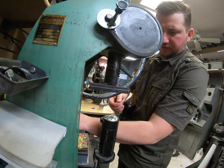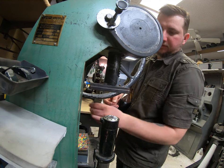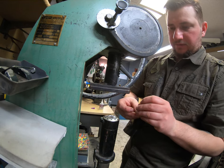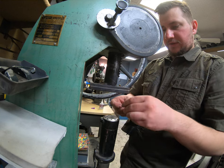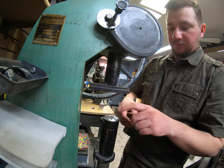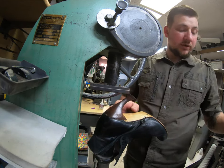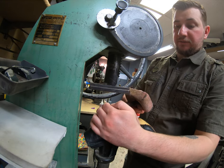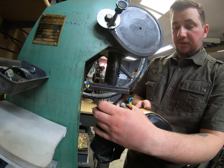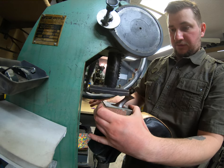And because there's a steel shank going through here, we're not going to add too many. We're going to do 4, just like they had originally. A lot of times, adding an extra nail is great and all, but the problem is that you might hit that steel shank and then you have problems with it going in kind of crooked or something. So definitely don't want that. Make sure that's sitting on there good.